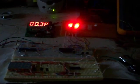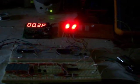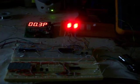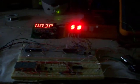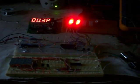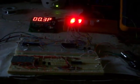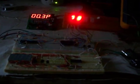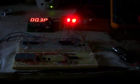The chip doesn't really tell you which one of the seven segments is A, B, and C, so I had to play around with all the wires till I found out which way is which. Yesterday I couldn't get it to run, though it's a very simple chip to wire. It actually has like one component, and strange of all things is because this chip needs all the displays connected.